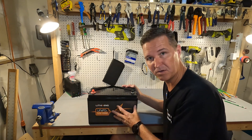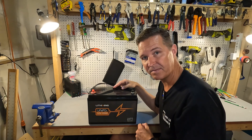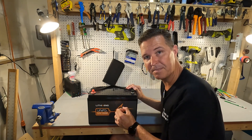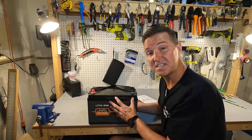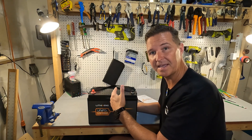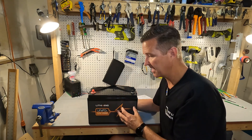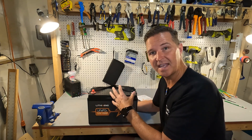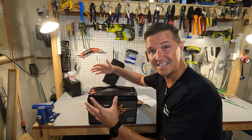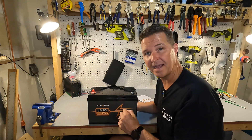This is your typical Group 31 battery case. The weight is 28.7 pounds and the housing material is ABS plastic. For series and parallel connections, you can take four of these and connect them in parallel for a 12 volt 400 amp hour bank, then connect four such sets in series for 16 batteries total at a 48 volt 400 amp hour bank.